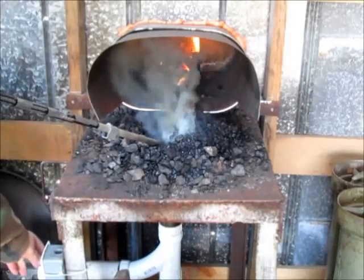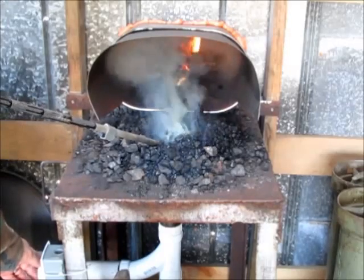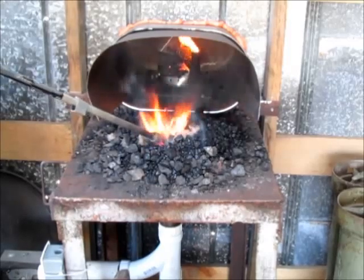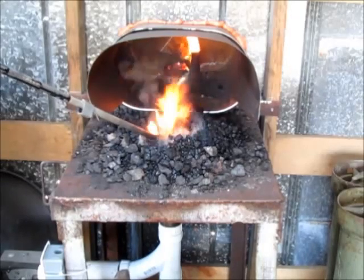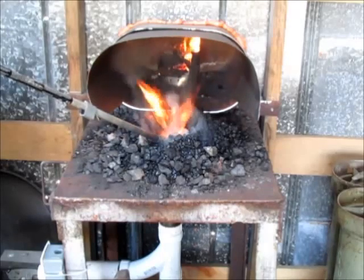The reason I posted this video was to show that chimney. I looked around trying to find something that was safe to use with the proper diameter, and it was hard. So I said I'm just going to see what I can do with what I have here — rolling that galvanized tin and making my own pipe seems to work pretty good.